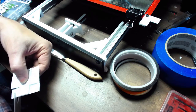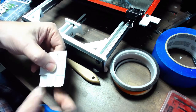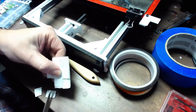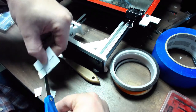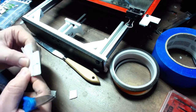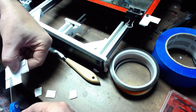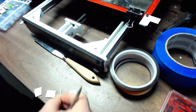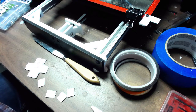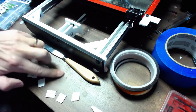I'm going to cut the insulation to size — no points taken off for neatness since it's all getting covered up by tape. Using Kapton tape is important because it all has to be very heat resistant. This is going on your hot end, so if it's not heat resistant it's going to burst into flames and do terrible things. Put on some glasses so I can see — it's important.